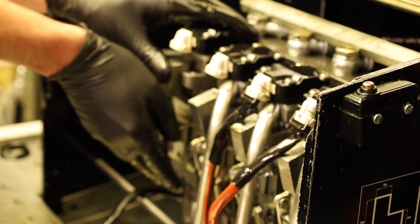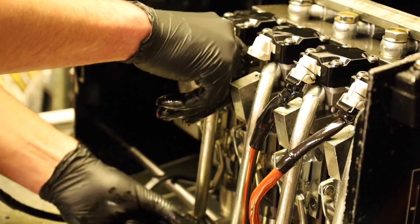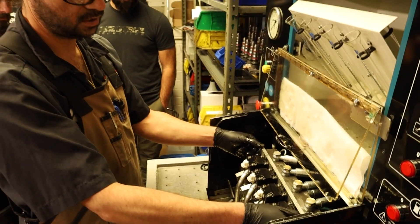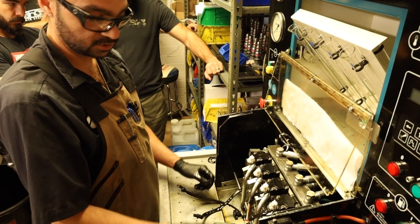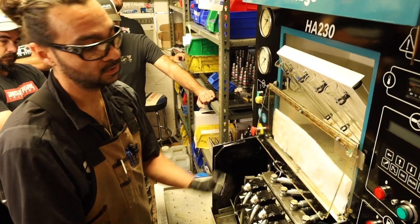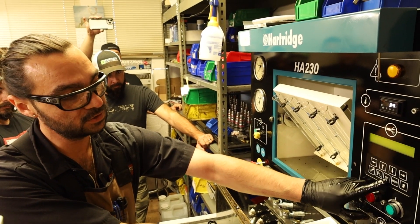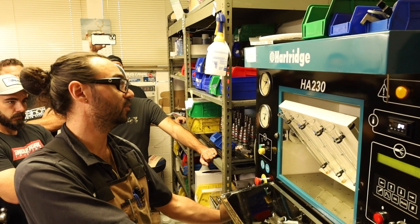This can spray you though, so be careful. And then here are the oil returns. A few things we look for are unusual running conditions — if an oil seat is not sealed properly, the oil return will just spray oil the entire time, and that is not good. We'll do idle first.